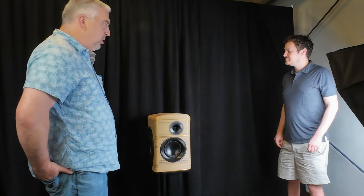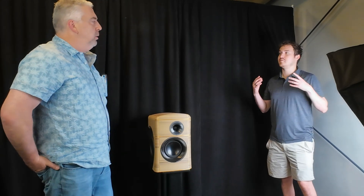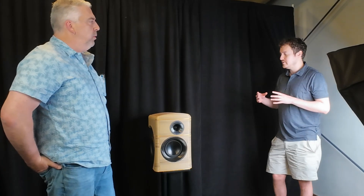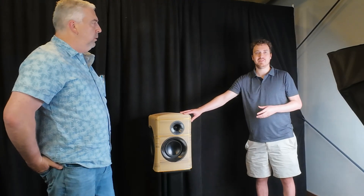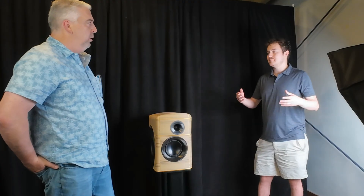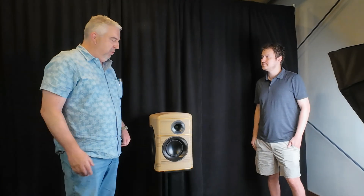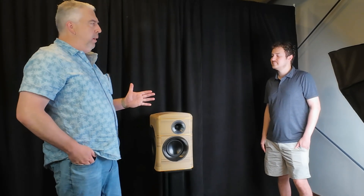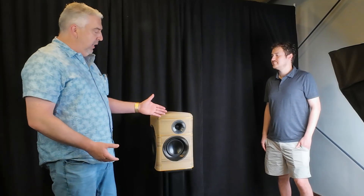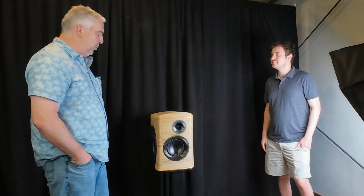These are amazing — they caught my eye and I wanted to give you a chance to explain to folks who are getting into 3D printing just how far it can be taken. The lowest hanging fruit is probably the front baffle — asymmetric curvature is something you normally don't see unless you're getting into five- or six-figure speakers. For fifty or sixty dollars of plastic you can make a nice wooden box and then design a baffle to print and adhere to the front, or even magnetize it to the front. You can incorporate a waveguide right into the 3D-printed baffle.